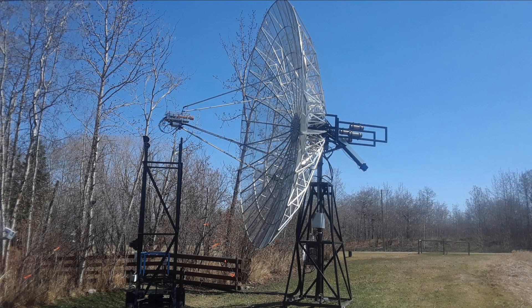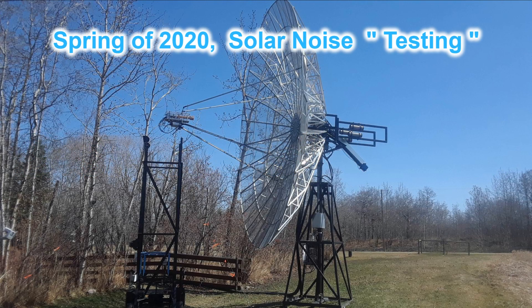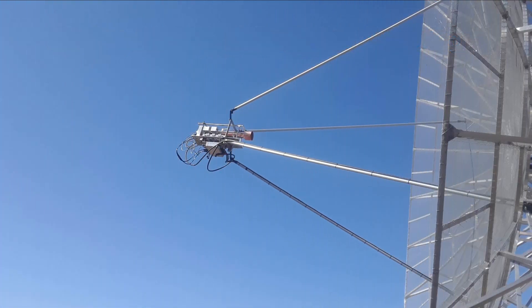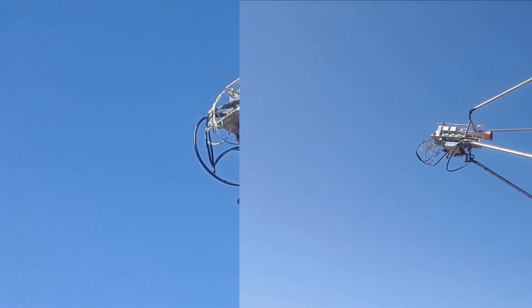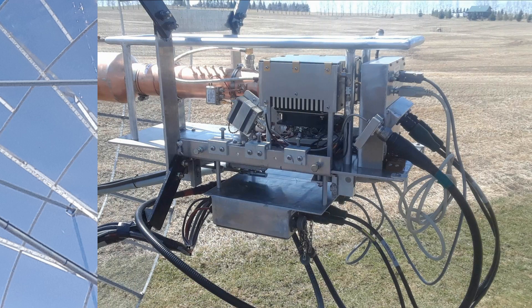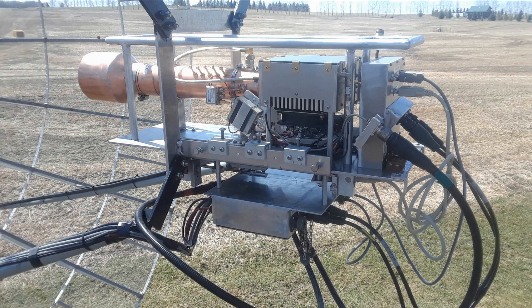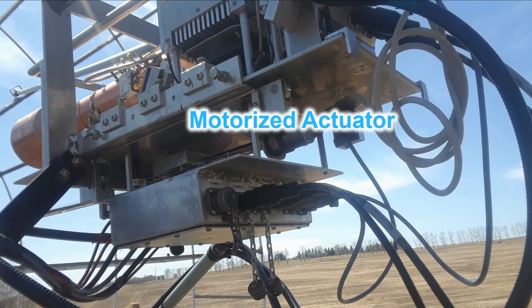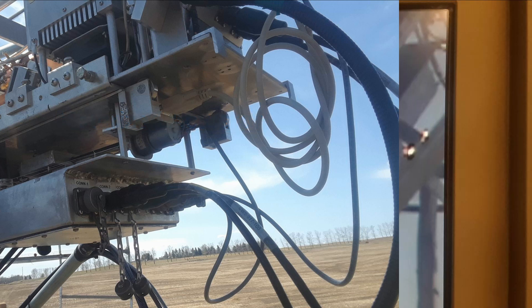This is back in the spring of 2020, where I got the feed connected to the dish for the first time. The main goal was to peak on the solar noise to find the main focal point of the feed horn opening. These next pictures show how it all mounted up and connected to the dish interconnection box. It also shows the motorized feed drive I used for moving the feed back and forth to find the focal point — it all worked very well. Using a closed circuit television camera I could zoom in on the feed and watch it move in and out.